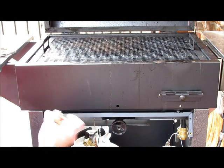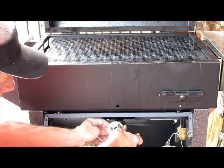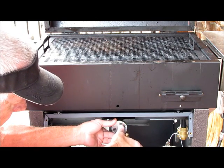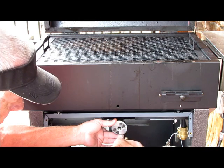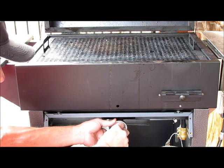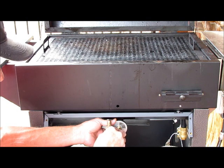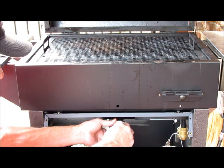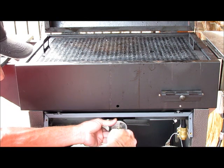Then you'll want to reassemble it. Remember, I'm going to try to keep my air shutter in the same spot — I made note that these two lines ran at the 12 and 6 o'clock mark. So I'll start the threads screwing it right into the burner. Don't force it — it'll fit. Just get it started straight. You can see it'll sometimes hang up a bit.